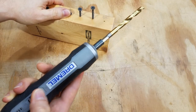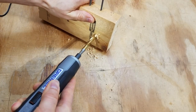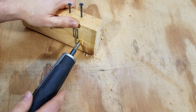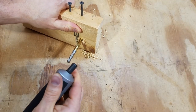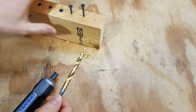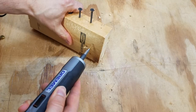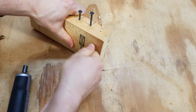To prove it can handle a fairly big drill bit, I tested a 5/16-inch bit through a 2x4 — it managed to drill all the way through, though you could tell it was working really hard. The problem is the bit gets stuck in the wood because there's no locking bit collar, so hitting reverse doesn't always bring it with you. It's possible to drill holes with this, but not ideal — especially with bigger bits, they always pop out of the hex holder. Even with a smaller 1/16-inch bit, it still leaves it in the wood.